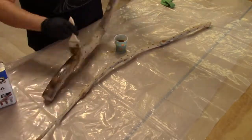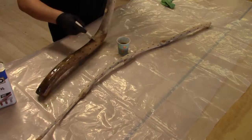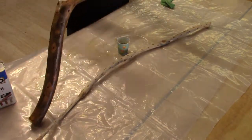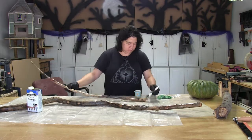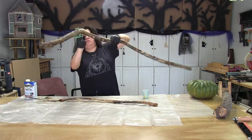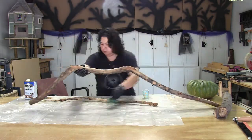If you are doing any kind of oiling, you want to make sure that you deal with your rags properly. Teak oil is combustible. Usually I will have a bucket of water that I throw any of the rags, gloves, brushes, things like that in. It separates the objects from the oil. Because it's in water, it can't really catch on fire. And then I just let the stuff evaporate and I end up with a hardened shell of finish. You can skim that off and throw that in the trash.